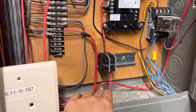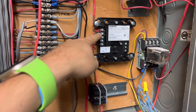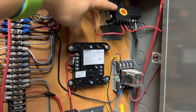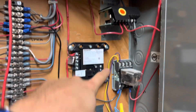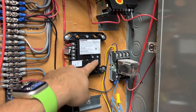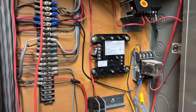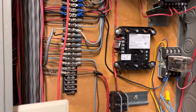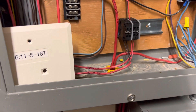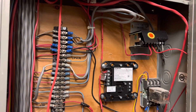Basically just tapping off the power right here — power in or power out — and then the power for the third floor, and then onto the rest of the devices on the rest of the floor. Here's the old one right here. It's a little different style. We'll take the wires off and put them on seven and eight on the day that we switch the fire alarm over. I didn't label this, but I think Steven came behind me and labeled it, so that's what finished these up today.